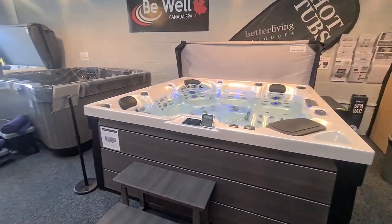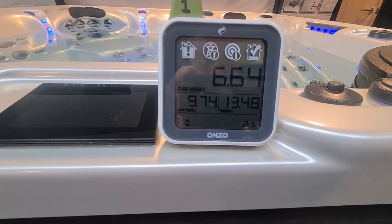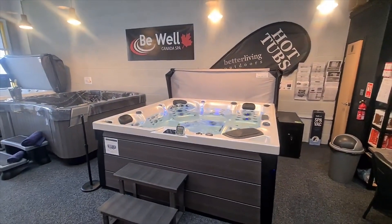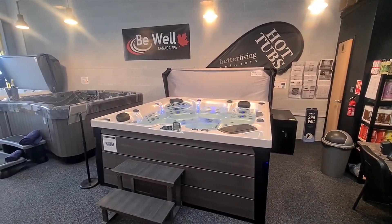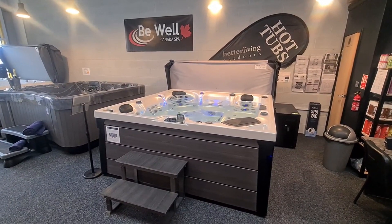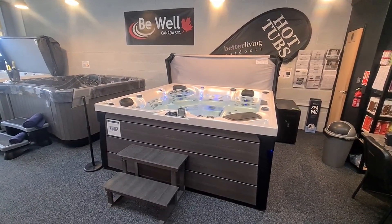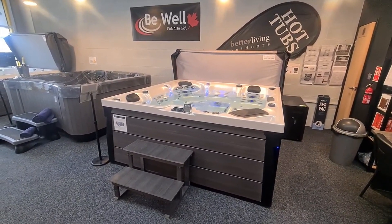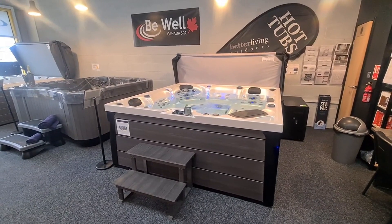So what are the scores? Running costs for the last seven-day period — as you can see in the bottom left corner — is £9.74. That's based on a 29 pence per kilowatt rate, which means this hot tub has used 33.5 kilowatts over the last seven-day window. That's keeping it on permanently at 37.5 degrees with three 30-minute bathing sessions, lid open, all four massage pumps running on full speed. From previous experiments we know that normal running — including two one-hour filter cycles each day — uses around 13.5 kilowatts a week, meaning the air source heat pump itself has used 20 kilowatts to heat the spa and keep it at temperature.